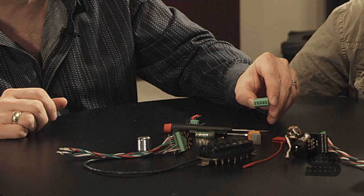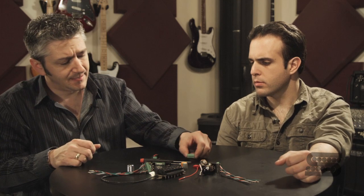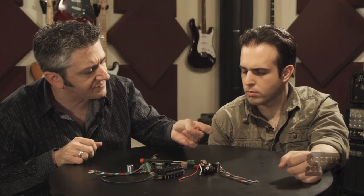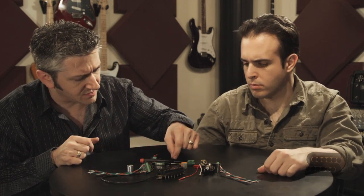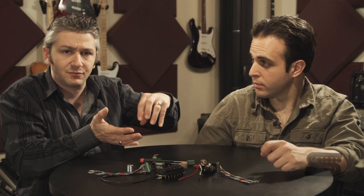Here's one that's bigger — oversized. You try to line up ten of these in an electric guitar control cavity and it's just not going to fit. We put it in a real thin, slim-bodied guitar and everything fit just fine. But then some people started sending us other connectors saying, 'this one's less expensive, can you substitute this?' We took them apart, and the screws were more roughly machined, didn't look good, and the tolerances weren't as tight. We also noticed the block was shorter, so you end up with fewer threads in each block, which translates to the ability to wear out over time.